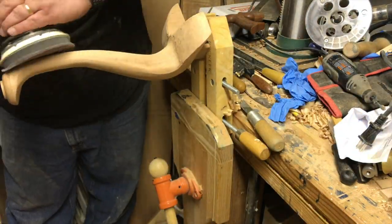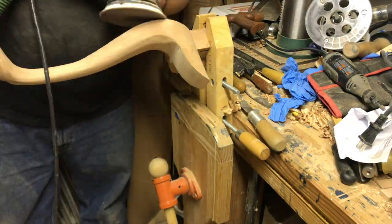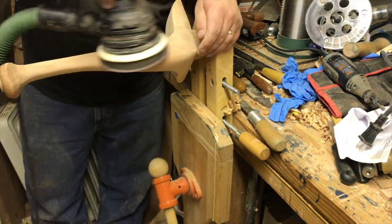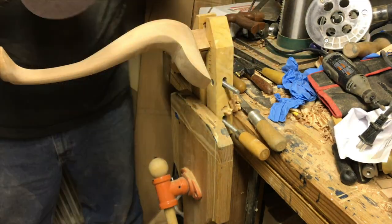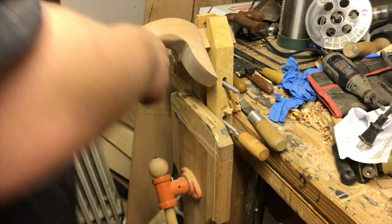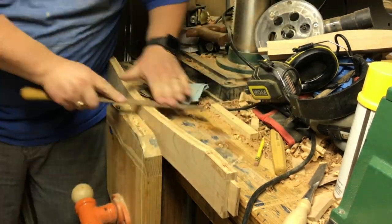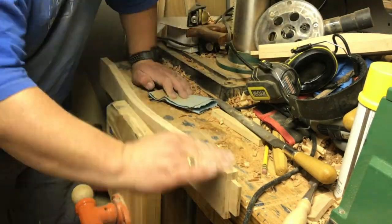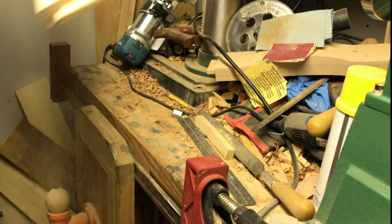On the previous table I built like this, I didn't do transition blocks at all, and I think it does make the table look a lot better with them. For the sanding, I used an interface pad along with some Mirka Abranet paper to be able to follow the contours of the legs and get those finished to a nice surface. It was basically rinse and repeat for all four legs. I went through a similar process on the stretchers — cut tenons on the ends to fit into the mortises on the legs, then routed a groove on the upper inside of each stretcher where the steel Z-clips will go to hold the tabletop to the stretchers.